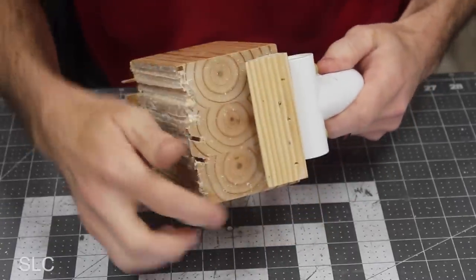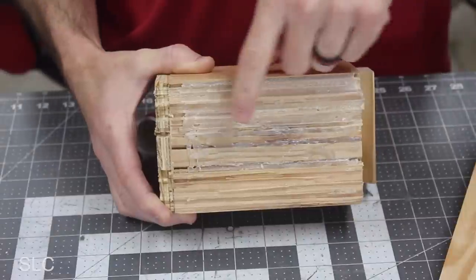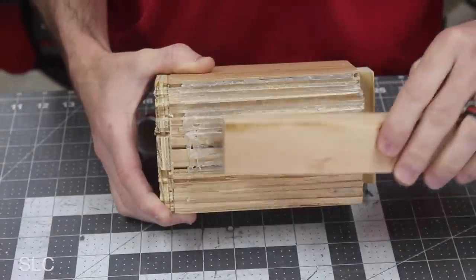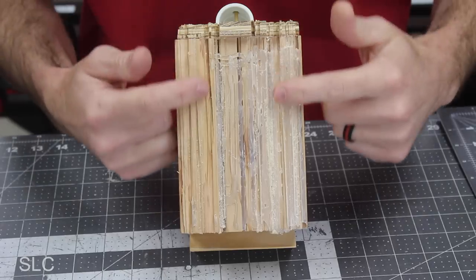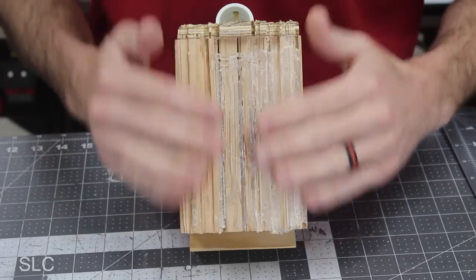The main body of this is inexpensive and can be built really easily. It has plenty of grip on the bottom, providing a lot of control, especially with smaller pieces. And the bottom is designed so that if it comes in contact with the blade, that is okay, as long as we have a nice firm grip on whatever we're trying to cut under it. The base and grip can be filled in over time for extended use.